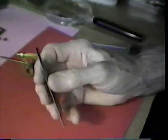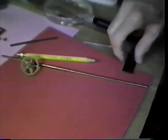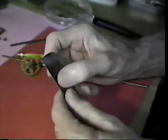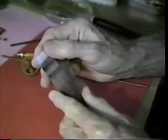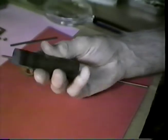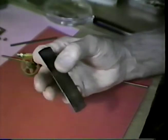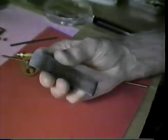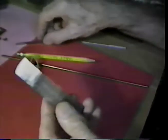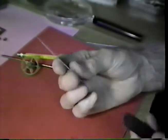So that makes the raw material for this work a little difficult to obtain if we approach it from this standpoint. However, there is a piece of raw material that you have available in your own shop that is very, very good. This is a piece of 8-day mainspring. This spring is about 3/4 of an inch wide, 16-17 thousandths of an inch thick. It's a piece of a spring that was broken or replaced for some reason. Now, this spring is about, let's say, 16 thousandths of an inch thick. This material here is about 35 or 38 thousandths of an inch thick.